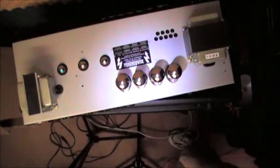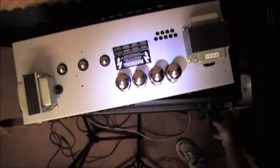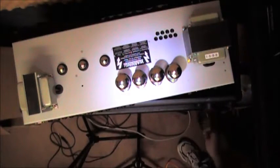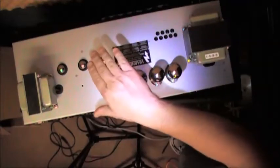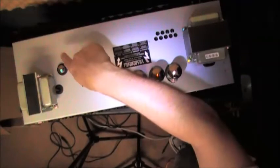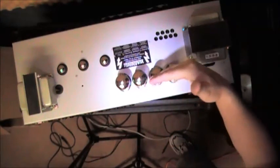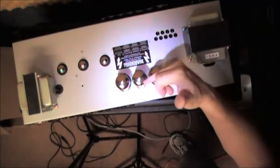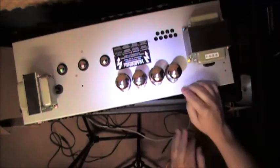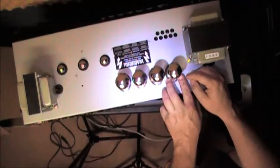Okay, welcome back to my first YouTube video, grand opening, stellar, super great, whatever. Because right now, we've already heard the symptom. These are our preamp tubes. They're fine, I believe. So I'm going to remove each one of the power tubes, which happen to be EL34B's STR TAD brand.